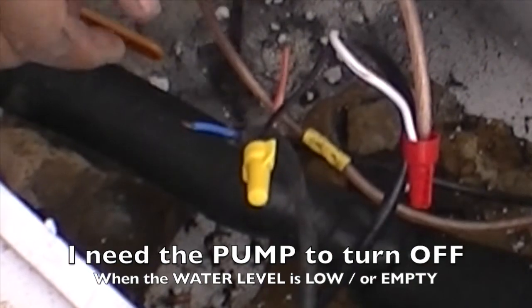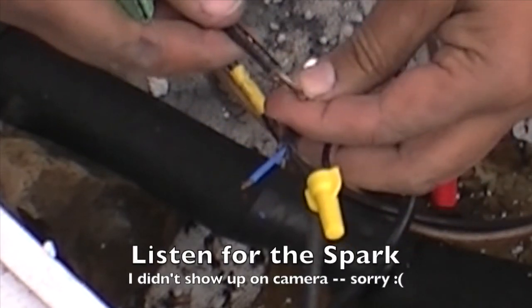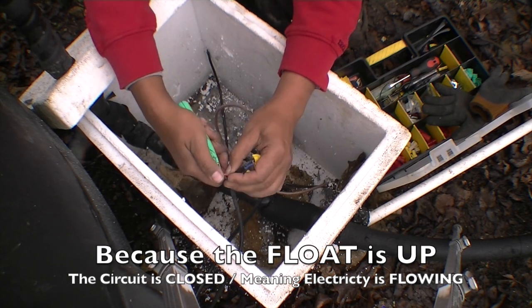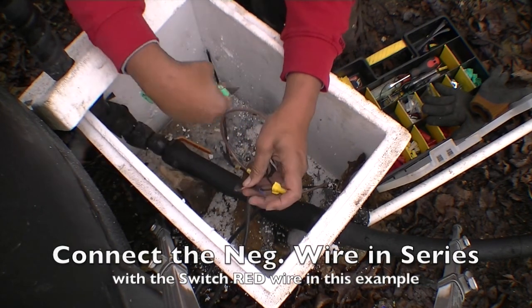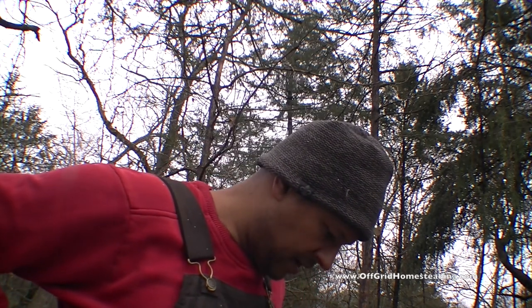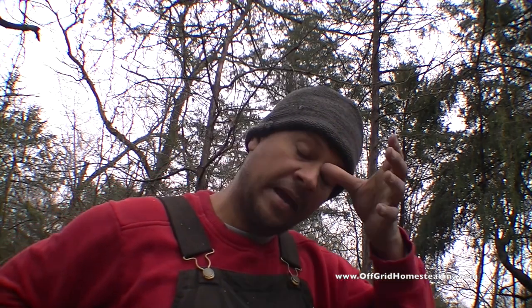The way I can check that — real simple. If you look close: no spark. Look here — spark. So you've got a closed circuit on the red wire right now. And that's what I want: I want it on when the water is up, I want it off when the float drops. So I'm going to put the cap back on, gather up all my gear and take it back to the top of the hill. Then I need to come down here and fill these holes up with some silicone to keep critters from getting in. And as soon as I get a break in the clouds for a minute, I can go up there after a few minutes and we should be hearing water pumping into the upper cistern.